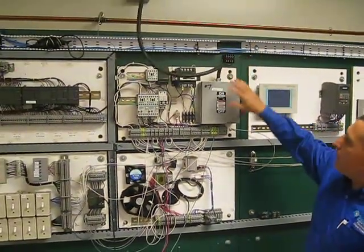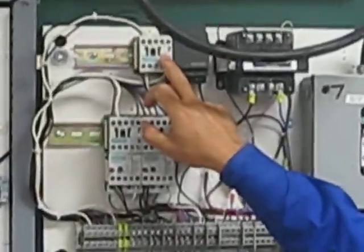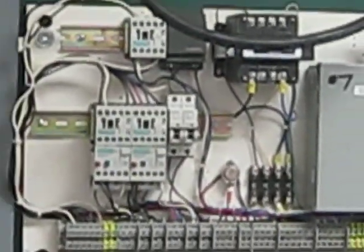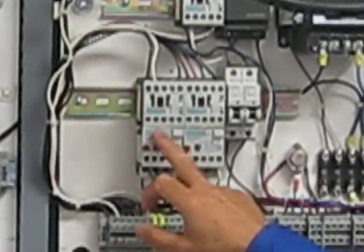The PLC runs on 120V and we wired the system. Our system has a 240V three-phase supply coming to a disconnect, then we bring a 120V system into a safety contactor. That safety contactor is driven and controlled by an emergency switch here, and also an on/off switch. This on/off switch controls our control system, and we also have two magnetic starters — one single-phase and one three-phase — to simulate the two pumps.